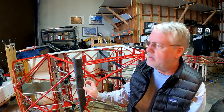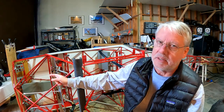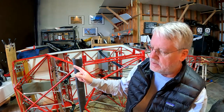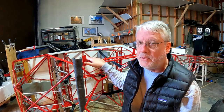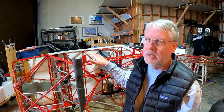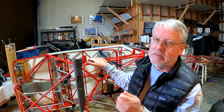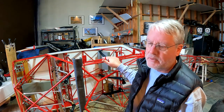First, what you're looking at — the fuselage is on its side. I just used a quarter sheet of plywood, two by four feet. Rather than making some kind of fancy rotisserie, I just mounted it up to the firewall locations. That keeps the side of the fuselage off the ground, which is really all I need. The main point of this episode is to get both sides covered on the fuselage. I have the pieces cut and the adhesive already on the fabric, but I still need to put the adhesive on the framework before I can get started.